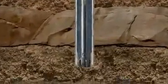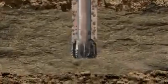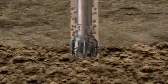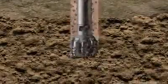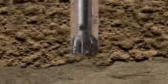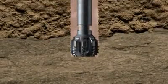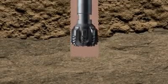With the riser in place, seawater is replaced by a special fluid known as drilling mud that is pumped down the string and exits through ports in the bit. The mud not only cools the bit, but also clears the cuttings from the hole. The cuttings are captured at surface and examined by geologists to characterize the rock types that are being penetrated.